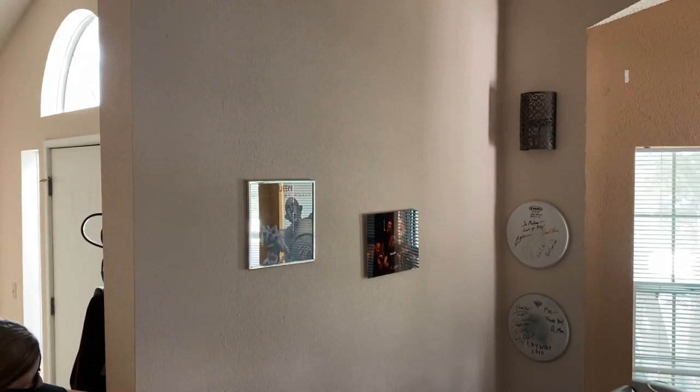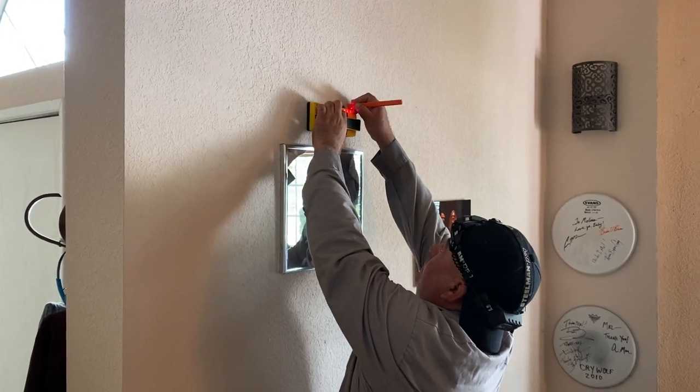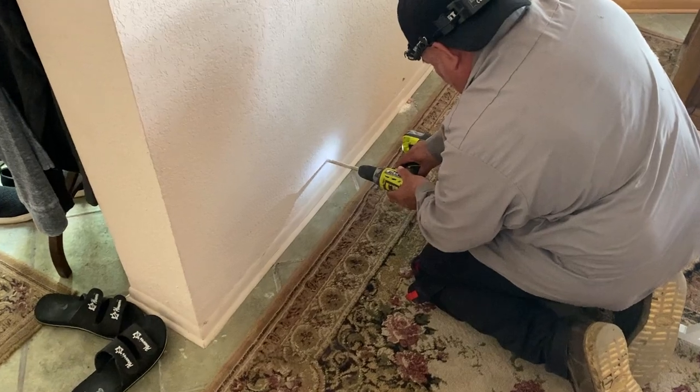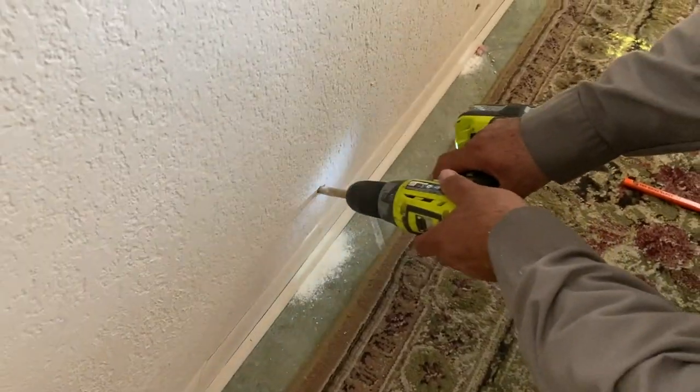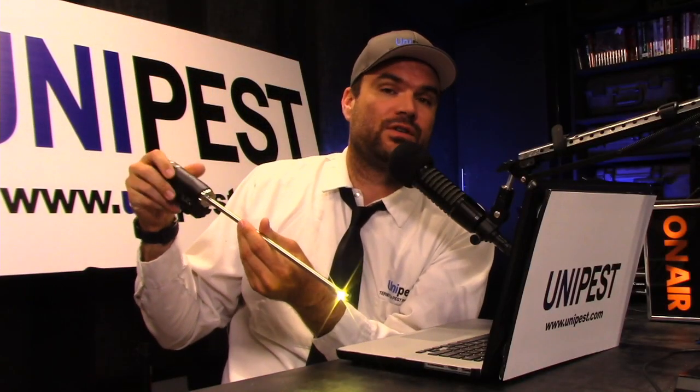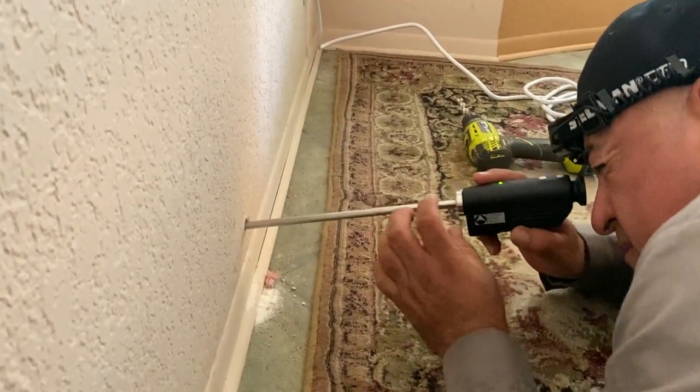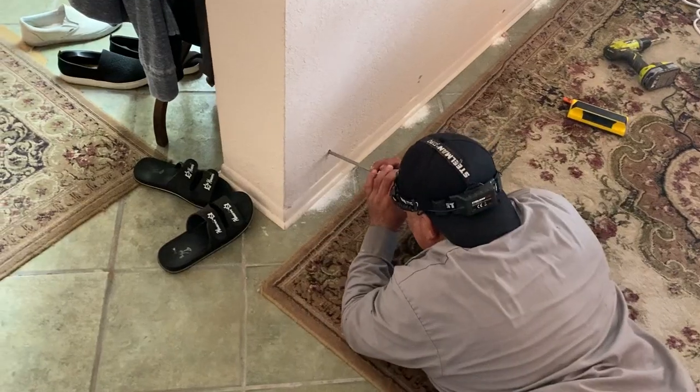Here is the process and how it will save you from having to do fumigations. First, you show up to the customer's house, identify that kickout hole, and find where the infestation is. Once you've found it, take a stud finder and mark all of the studs in the wall. Then drill a small half-inch hole in the drywall at the base of the wall at an angle so you can slip the boroscope in to look at all of the studs behind the drywall and figure out which ones are infested.